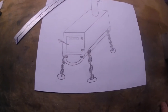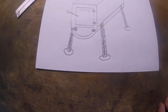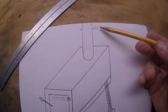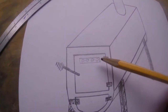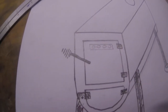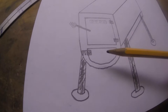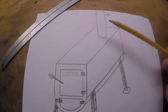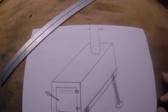So let me draw something up and show you guys what I come up with. I plan on putting some type of a flue damper up here to control the burn — how fast it burns. I'm also going to put a sliding vent right here, install an access door to put wood in, and there's also a door to clean the ash out. I'm going to make the legs out of some galvanized pipe I have laying around. I'll probably buy the flue and the flue mount and flanges at Home Depot.